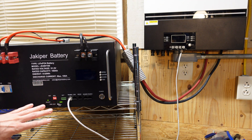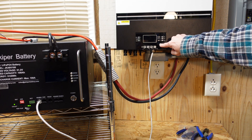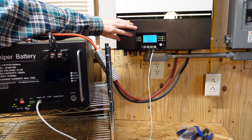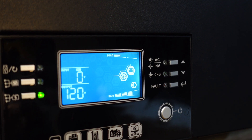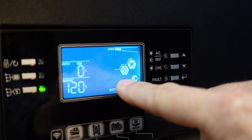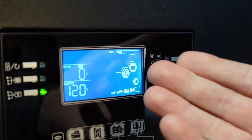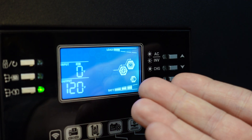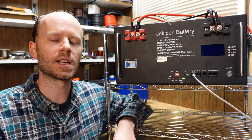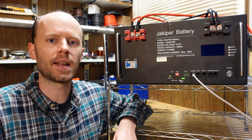Now we have our battery turned on, we've double-checked all the settings and cabling — go ahead and turn on the inverter. It can take up to a minute for the inverter to begin communications. Taking a look at the inverter, we can see it has completed starting up and the battery light is flashing, which means it has established communications with the battery and they are communicating back and forth normally. Additionally, this has been running for several minutes now and we see it has not shut down with fault codes like it has before. Successful communication between the Jakuper battery and the MPP Solar LV6548 at last.